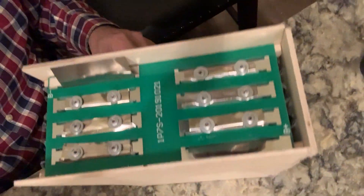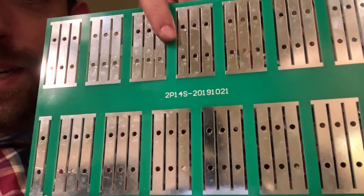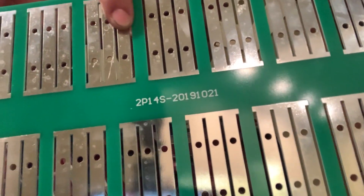Tell me what you think - it's pretty easy. I have a ton of these boards. The ones that I ordered for myself are 7S 1P and also 14S 2P. So this is a 48 volt, 80 amp hour one with the cells that I'm using. I'm not saying you have to use these cells - you can use any cell that fits in here. The A123s - I think they're around 20 amp hours, so if you did it would be 40 amp hours by 48 volts. If you find another cell that's more energy dense, you're able to use that. I have the measurements so you can figure out if the cell you're looking at will fit.